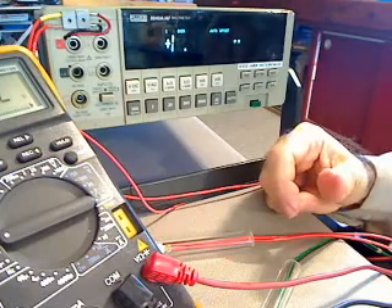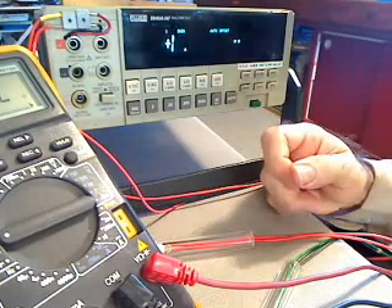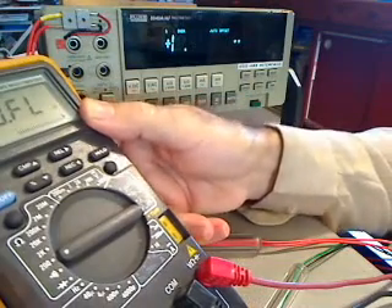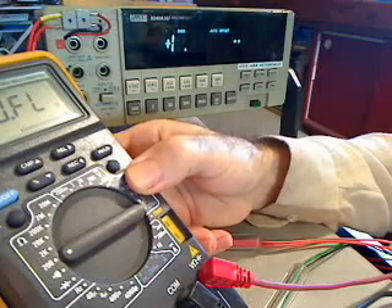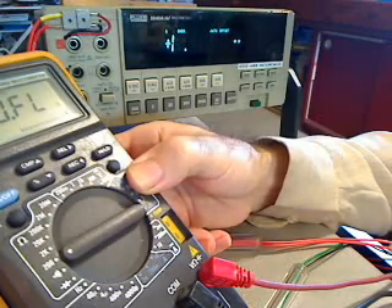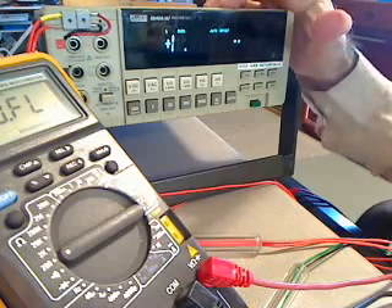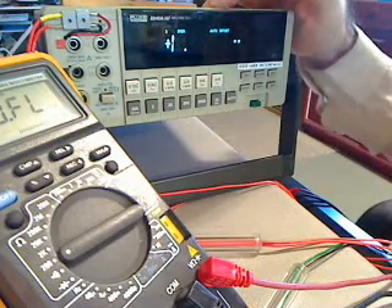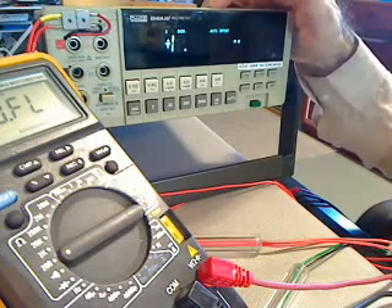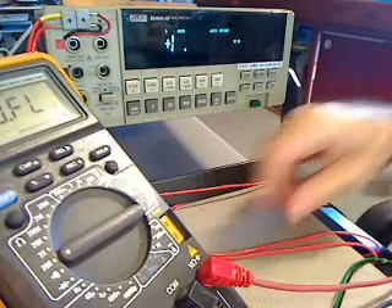It's really crucial to use a reference resistor — whether it's an armature or a specific resistor — and use that same one throughout the season so that anybody can take their meter. Say Harry takes his meter and reads 2.9 on the reference resistor; if that's what they're going by, then he knows he can measure his armatures and if they're 2.9 or above he should be legal. On the other hand, if an armature from, say, a race products supplier measures 2.9 or 2.8 on a calibrated lab-grade meter checked against a reference resistor, that armature is not legal, and you should take it up with them.